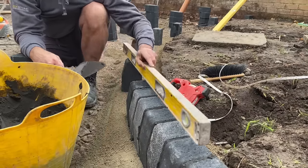It's important when you're laying block to check you're keeping square and running through in the line, especially here where the pattern's fanning out and going wide. It has a tendency to start curling back in as you go, because you lose your nibs on contact with the block, so it tends to curl back. I've got that line square with the house right through, so I'm just checking that is true all the way through, and it is. Every few meters I sight it through or check it with the line. If it looks out, straighten them up.